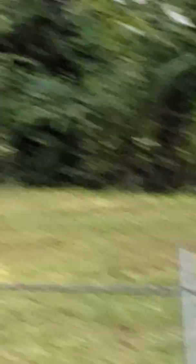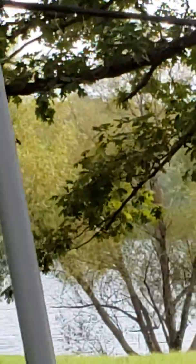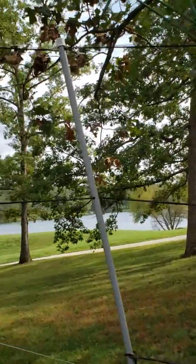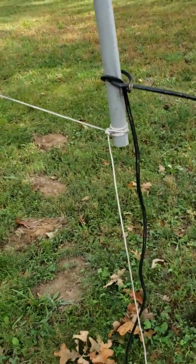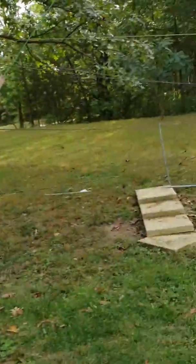Previously, the five wires at the very first spacer — that spacer was about seven feet long. They really didn't get any longer than eight feet on any of them, because every time you got to a spacer you're losing one wire. But by the time I got out to the third spacer, those three wires had four feet in between each of them. With an eight-foot piece of conduit, wire number two was down here and wire number three was about eight feet from the top wire. So it was a big, massive antenna — and it still is a big, massive antenna.